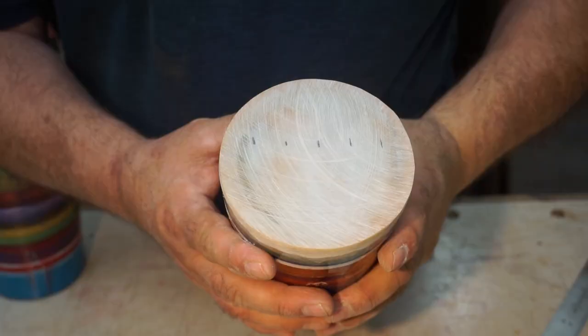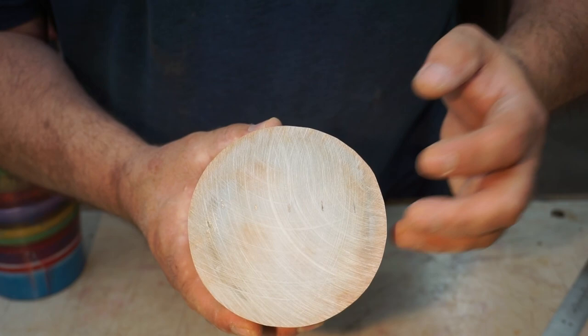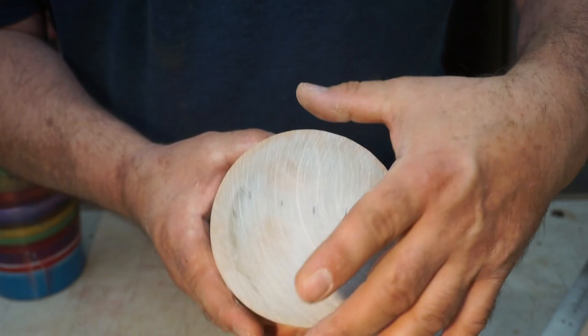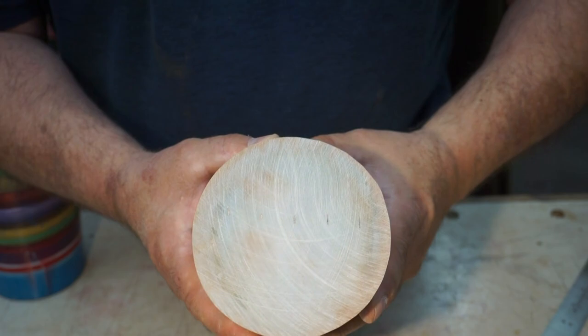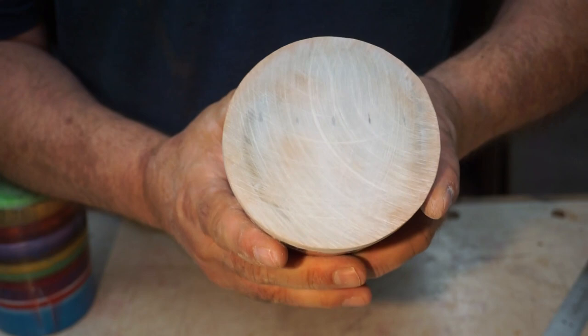All right, so I've just quickly figured this is about 5/8 of an inch. So I think what I'm gonna do is just cut these 5/8 of an inch on the bandsaw. This is going to get skinnier as it goes on the outside, but I'm going to do this one and this one as well, trying to figure out how big of pieces I can get with that. And I'll probably alternate them.